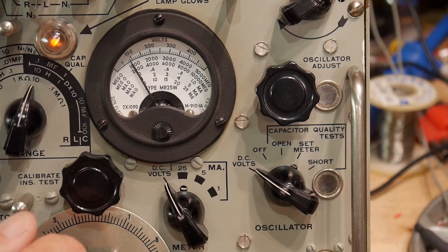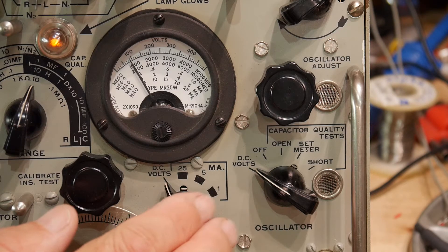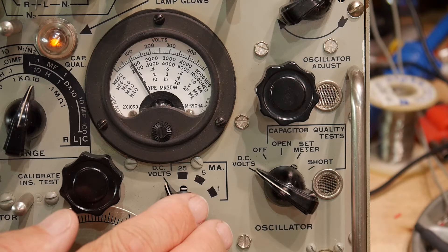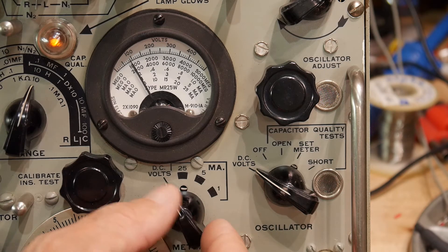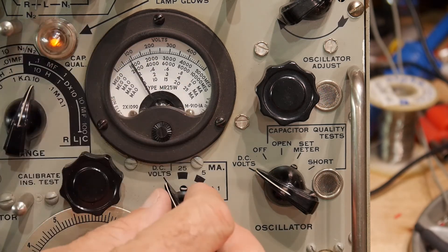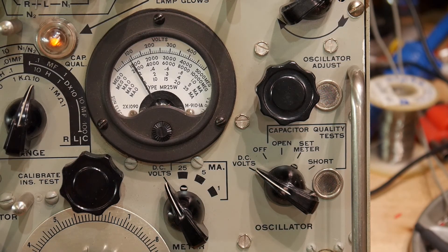So we could do the calculation: 100 volts divided by 100,000 ohms would be 1 milliamp. And since we have 1 megaohm, which is 1,000 kilohms, that would be 0.1 milliamps. So we are measuring 0.1 milliamps of leakage current at the test voltage. That sounds great.